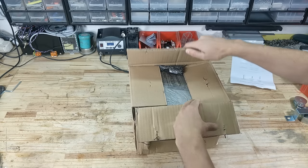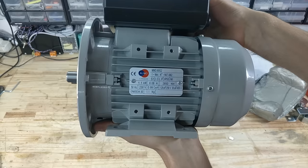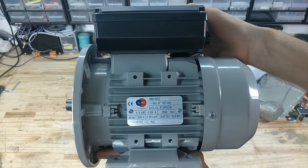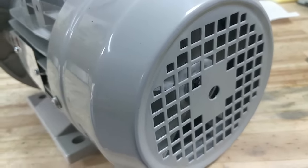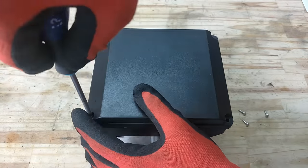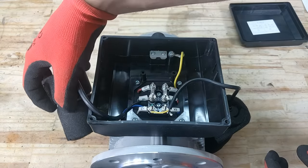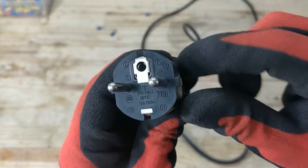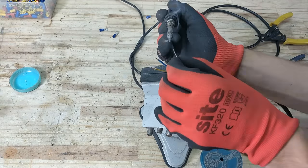Next, I needed to choose a motor. The motor I'm using here is a 1.1kW two-pole single-phase induction motor. This is completely overkill, as the mechanical load will never allow it to push out 1.1kW — not even close. In reality, I purchased this motor for another project that did need this much power, so I decided I'll temporarily use it to drive the siren. We'll measure the power consumption later in the video and choose a definitive motor accordingly.